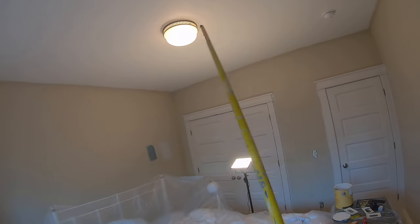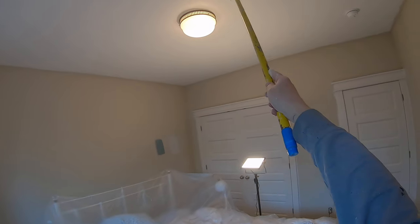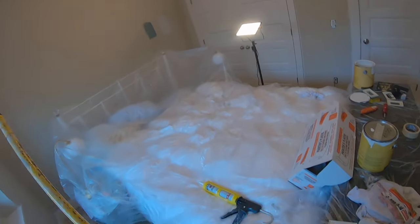Sometimes you'll see lap lines. These, you won't show as much. Right now, you might be able to see it. It might be, the wide angle may not help, but you can see a difference right now, but once it's all dry, you know. So don't ever think when you're painting, and you think that something doesn't look quite right, put it on and allow it to dry.